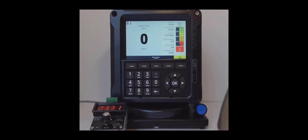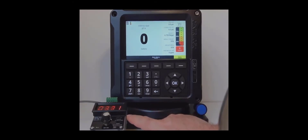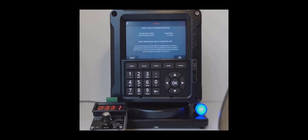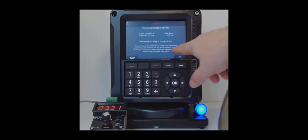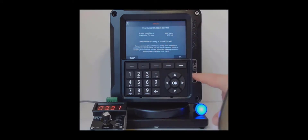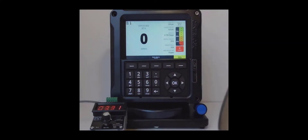Next, I'll simulate what happens when our current is below 4 milliamps. On my signal generator, I've set my signal to be below 4 milliamps, and I'm going to start a delivery. Once I start the delivery, my blue indication light illuminates, and within the allotted time the error pops up and you can see that the water detection was shut down. The raw current value was below 4 milliamps, and again it's instructing the fueler why it shut the system down and telling you to enter the maintenance key to unlock the unit. If I press OK, I can enter my maintenance code and press OK, and now the error is cleared.